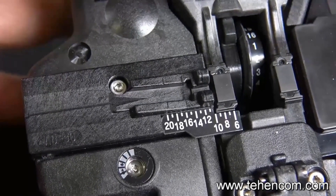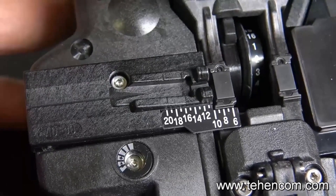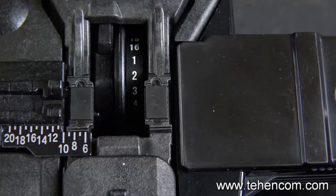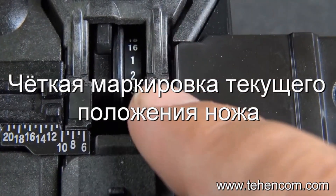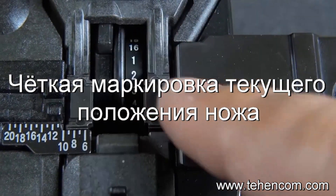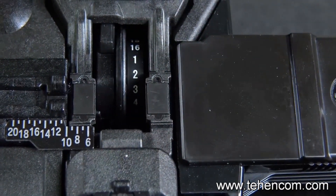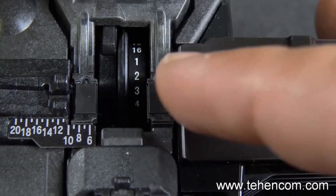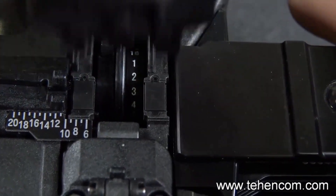You can tell it's numbered from six to 20, and you're gonna wanna cleave the AFL fast connectors at 10 and a half. Now one of the things I really like about this new cleaver is the blade itself. The position is numbered — one, two, up to 16. The blade life is about 48,000 cleaves. And then when you feel like it's not cleaving as well and getting a little dull, you wanna go ahead and rotate it to number two, lock it in place, and start cleaving.